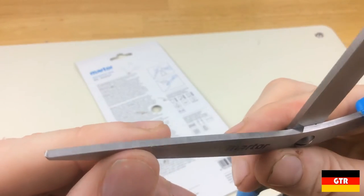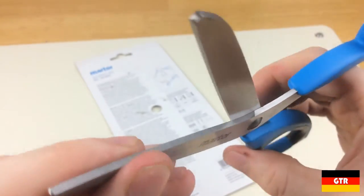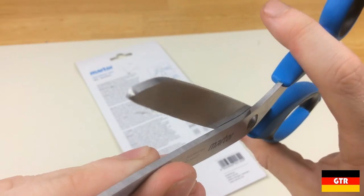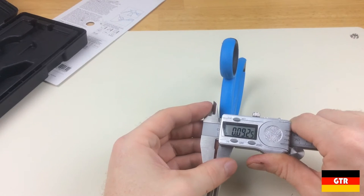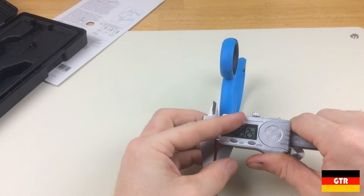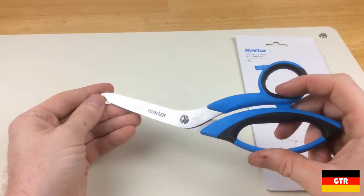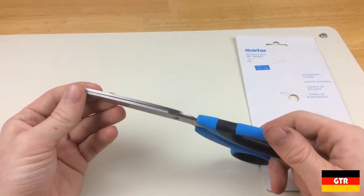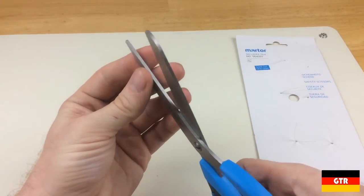You can see the two blades are ground down to a perfect right angle, and there is probably only a couple of thousandths clearance between the two as they close. In order to use this type of design, the blades need to have a lot of strength to prevent buckling under the shear loads. The thickness of each blade is around 92 thousandths, or 2.35 mm. The eyes of the scissors have a black rubber-like material and blue plastic, which seems too hard to be ABS — I would guess it is a PA6 nylon or some variant.